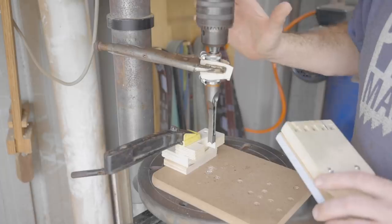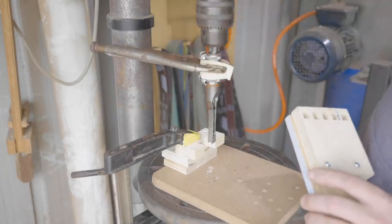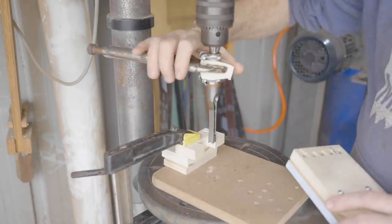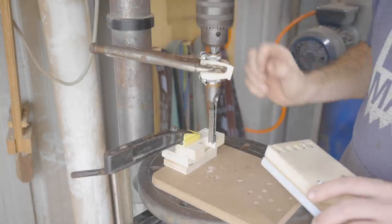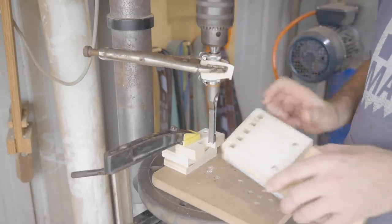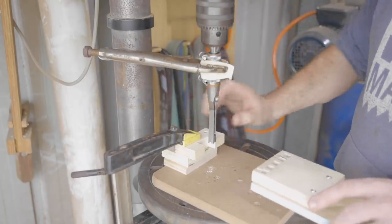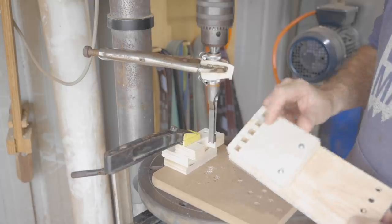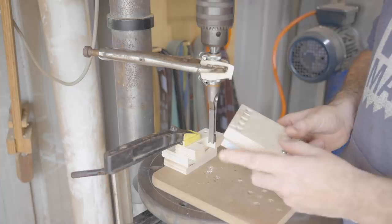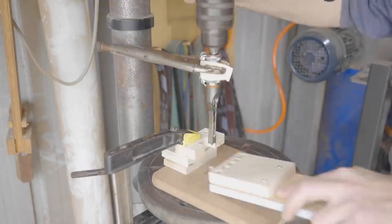I've just been experimenting with a couple of improvements — this is just temporary. I put vice grips on the collar here and when I start it up you can see that it stops it from turning, but I will make a proper holder out of plywood. This is not good enough to make a mortise as it wobbles far too much on the drill press, but because I'm using a guide that doesn't matter. I've screwed a few scraps to this board, clamped it down, and now I can make these without having to clamp the workpiece down. I've got the guide screwed to a piece of scrap which will be our workpiece — I can hook that under there, guide it into the right position, and make the cut.